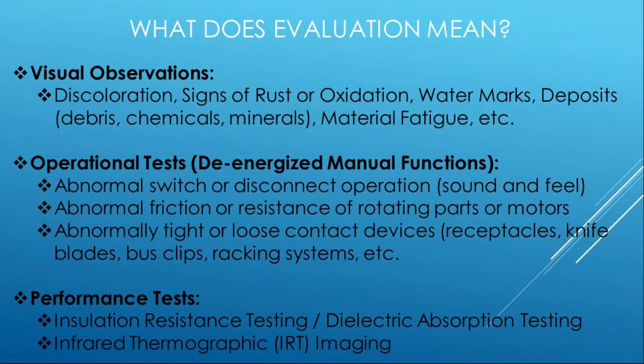And there's also infrared thermography. So you can do IR imaging and see some hot spots, right? So likely if you have corrosion or if you have problems with the current carrying parts, they're going to be escalated in temperature because of the high resistance connection that's occurring there. And that increased temperature is what's going to result in the failure over time or immediate.